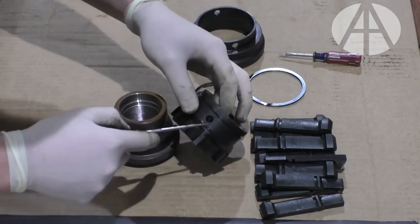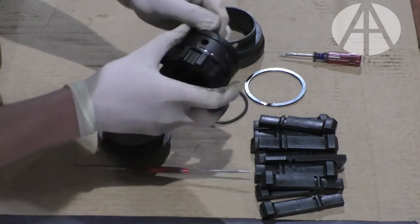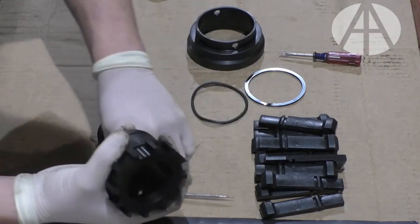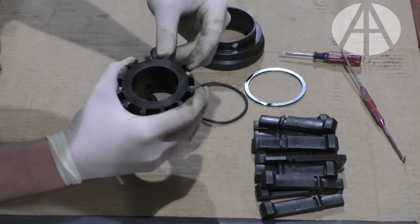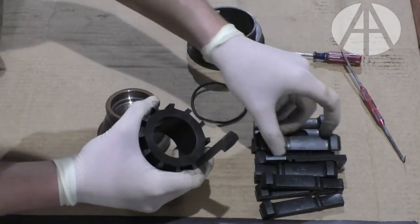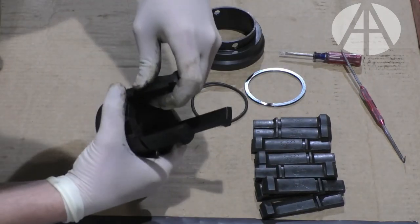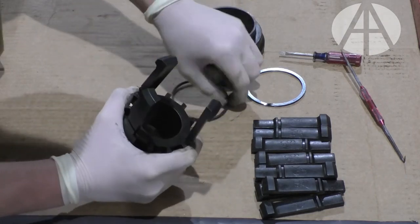So if you needed to take this O-ring out, obviously all you'd have to do is take a pick. That comes out. So for reassembly, you put a new O-ring on here, take the inner housing in one hand, grab around the outermost section of the inner housing. The way I do it, and there's more than one way to do this, is just stagger these jaws, hold them with one hand with your fingers like this. You have to put some tension here at this pivot point.